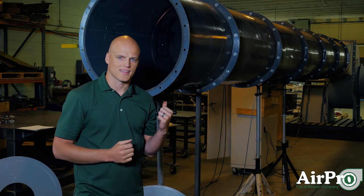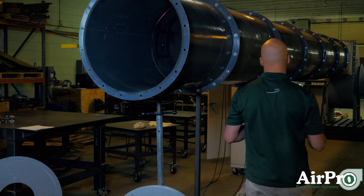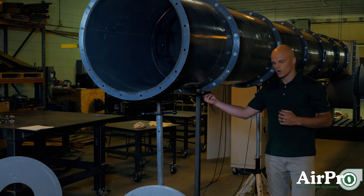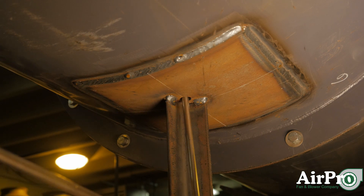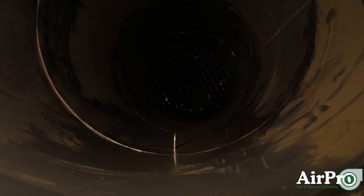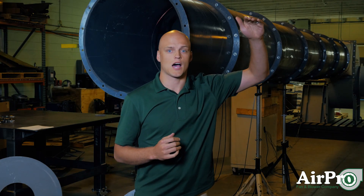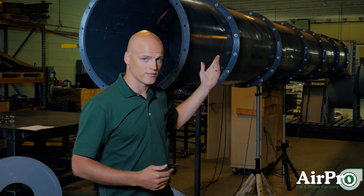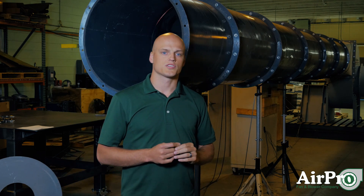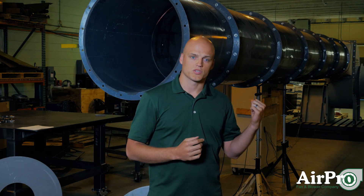Now I'm standing at the outlet of our test apparatus. Our test point is going to be read with this pitot tube, placed at a point that is eight and a half times the duct diameter length away from our fan outlet. We measure so far away because when air exits the fan it moves fastest at the top of duct travel, and we want that air to develop into laminar flow as it travels down the duct, so that at the measurement point we see the greatest velocity vectors right in the middle of our duct.